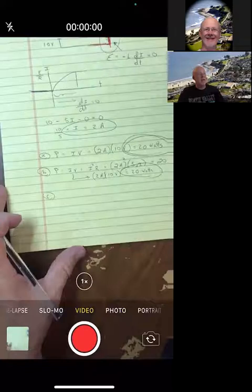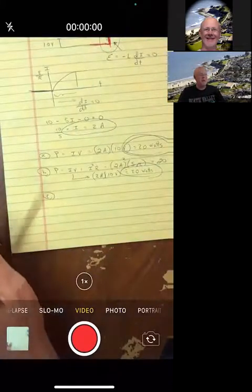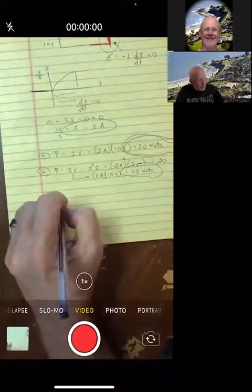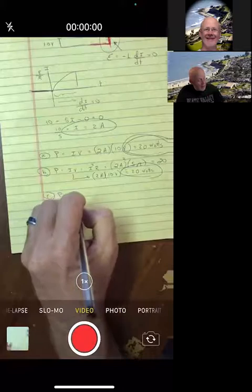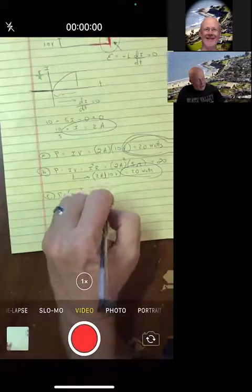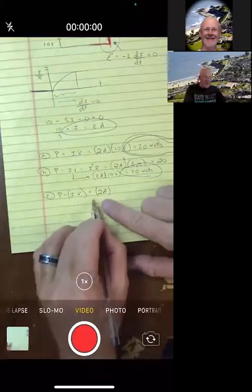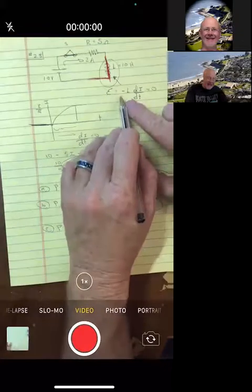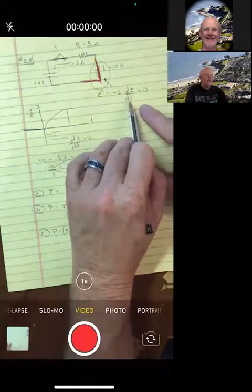All right, so in step C, we can go to the power being delivered to the inductor. Well, I guess I already said it, but I'll do it again. Power is the current times the voltage. And again, the current in the inductor at this point is 2 amps, but again, at steady state, the current isn't changing.